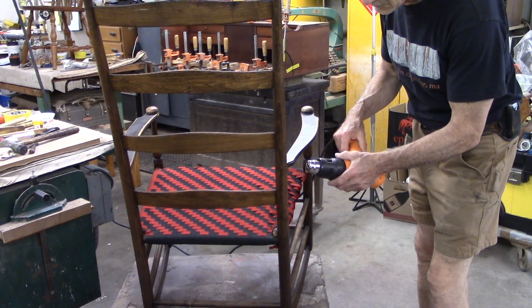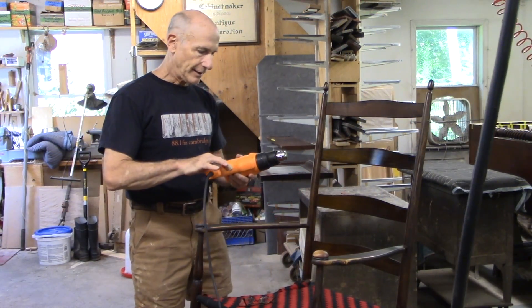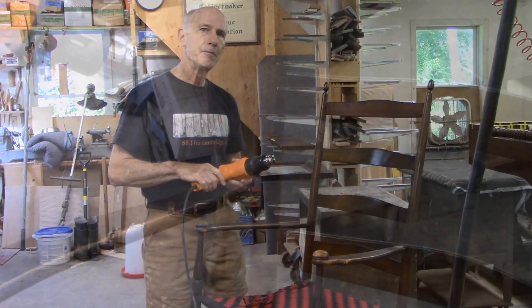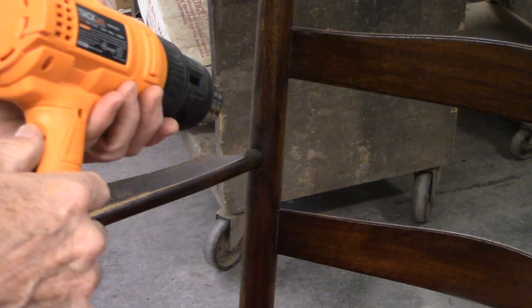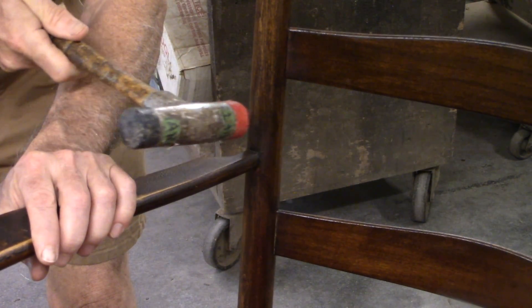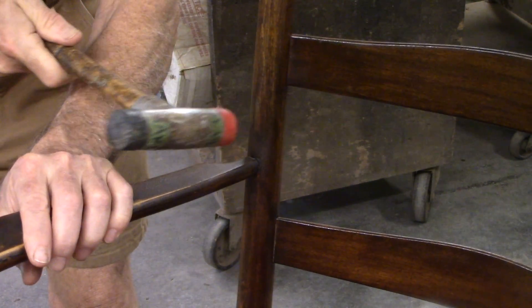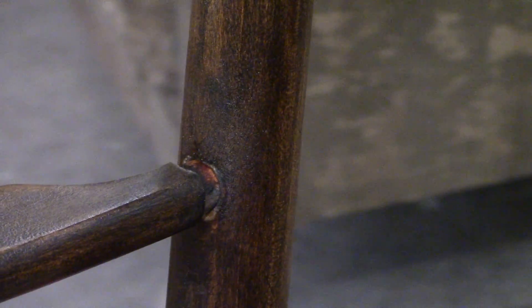When you're trying to loosen a joint with some heat, you have to be careful. I've set the heat gun just on a medium heat. I use a timer — I try to do each joint for two minutes, and then I'll tap it. You have to watch carefully so you don't scorch the wood or bubble the finish.